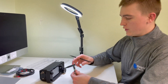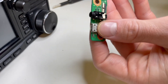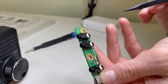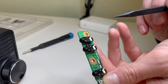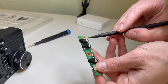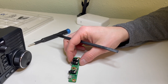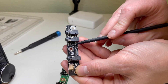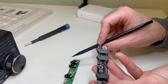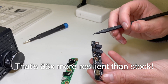On the original board, right in here between these two components are a pair of MOSFETs — transistors responsible for doing that switching. The problem is that on the original control board, these cannot handle very much current. When I tested my particular amplifier, it was only using about 30 milliamps, but that was enough to fry those two transistors. All of a sudden my radio wouldn't transmit just because of that issue. What we did on this replacement board is upgrade them — these two transistors take the place of the original ones, and where the originals got fried with just 30 milliamps, these can handle up to an amp of sustained current, which is way more than you'd ever need for this line.